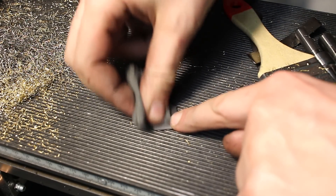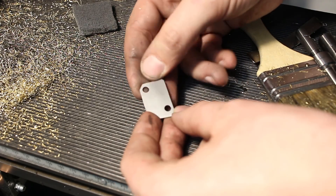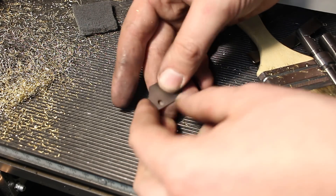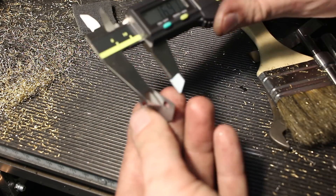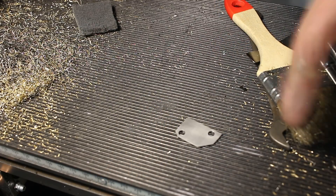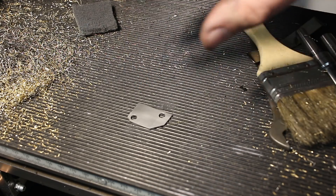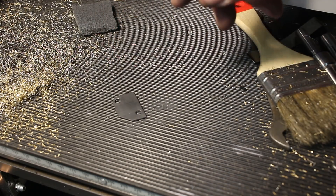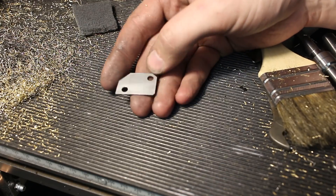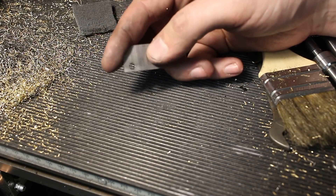Once you hit it with some Scotch-Brite, it gets pretty darn good. This is the original surface of the sheet metal, the milled surface, and then hit with Scotch-Brite. I didn't measure the thickness but I'd guess we're pretty close. It's also a good idea to take a spring pass, because even if you use a carbide end mill, the machine and the end mill will flex a little bit. So I hope you enjoyed this little technique — it can get you out of a pinch in a lot of cases. Thank you all for watching and see you next time.